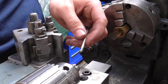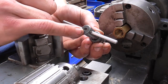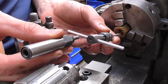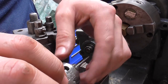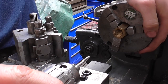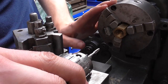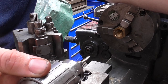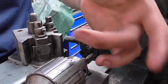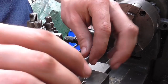There are ways of getting around that: you can put the tap in a tap wrench that has a center hole in the end and then use your spring-loaded center again, or what some people like to do is lock the tap up in a Jacob's chuck and wind the lathe chuck round by hand and allow the tap to pull itself in, or you can release the chuck from the machine taper and carefully follow it in, allowing the taper to rotate within the socket. All those work, and I've used all of those in the past.